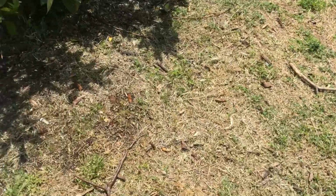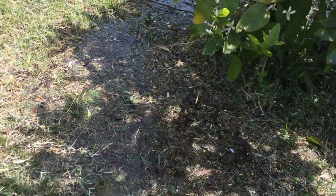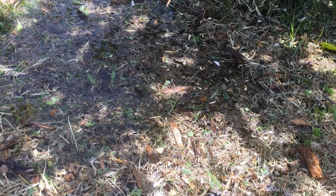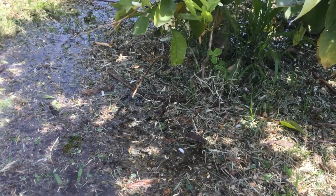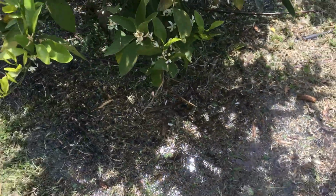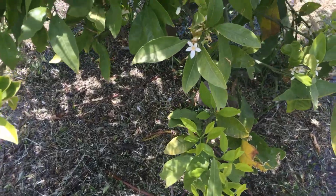Now here's one I've noticed that is super sneaky. It's not making a big loud noise and it's not spraying anywhere. But look, I've had the irrigation on for about a half an hour now, 40 minutes. And normally it's on a drip, so they just drip out slowly. But somewhere in here, the drip tube has a break in it, and it's just glugging out water, because there's like a moat of water right around it. Like I said, the irrigation's only been running for about 20-30 minutes.